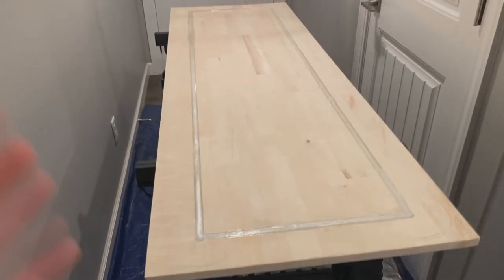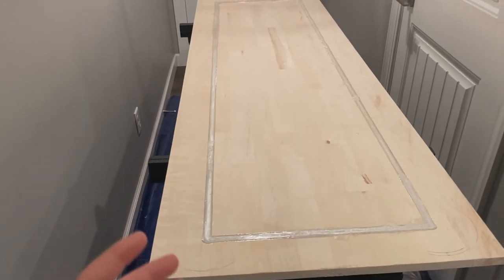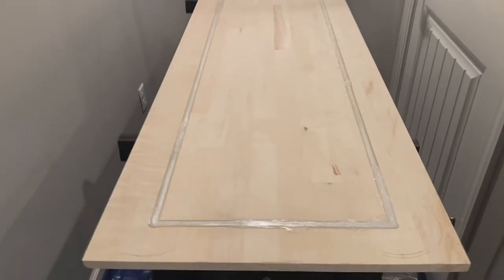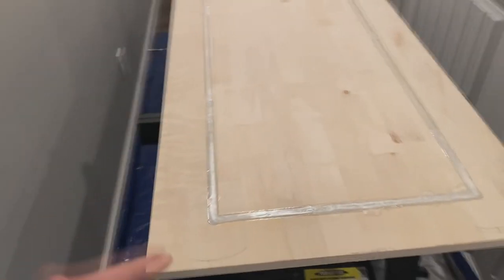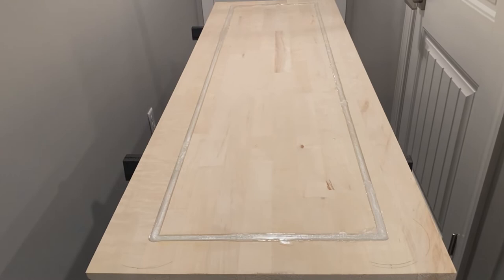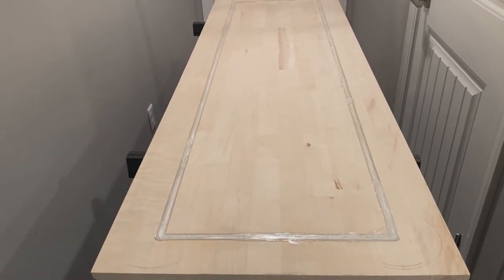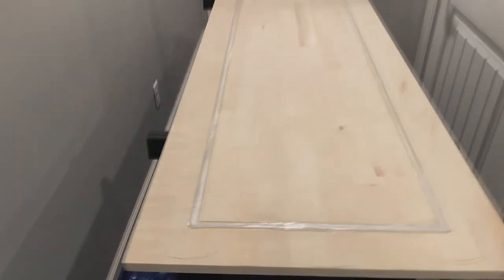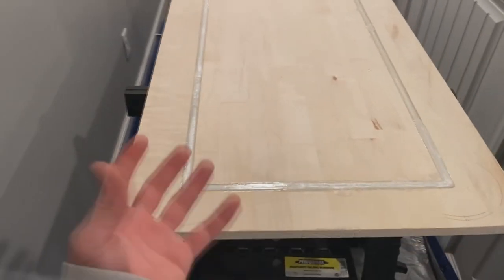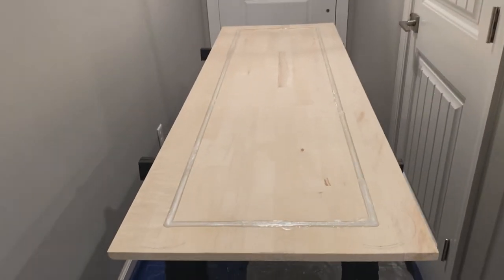And then I didn't think we'd have enough epoxy to finish, but what we did was we just started mixing small amounts of epoxy in the same cup over and over, mixing pigment in, and then doing it layer by layer. Did that 5 or 6 times. Still, I think we did it too quickly. I should have been a little bit more patient, because in some areas where the pour got pretty thick, it started to smoke and steam, which means the layer is too thick and the reaction isn't going right.